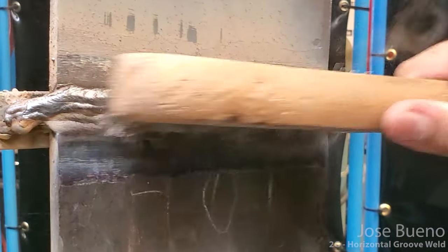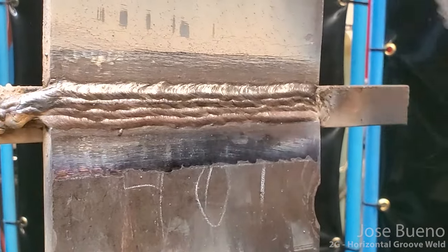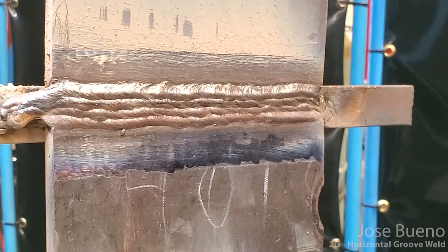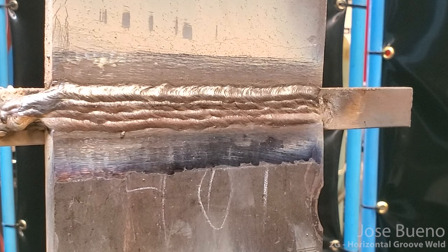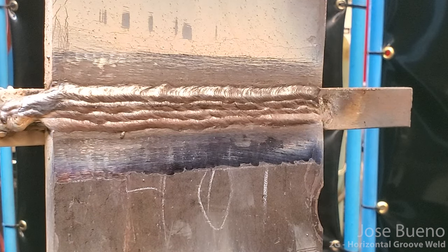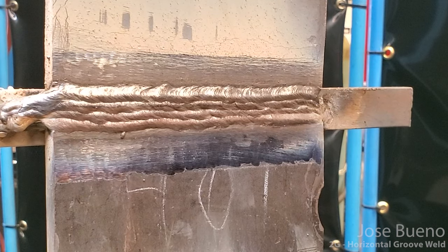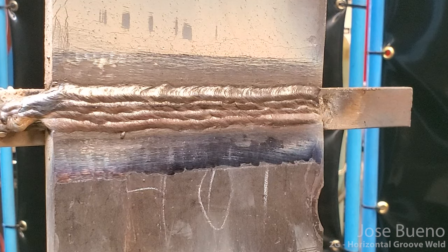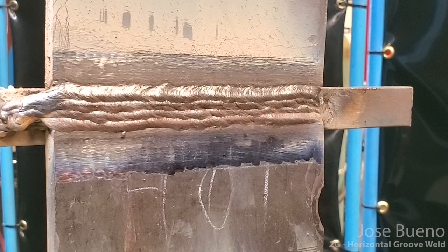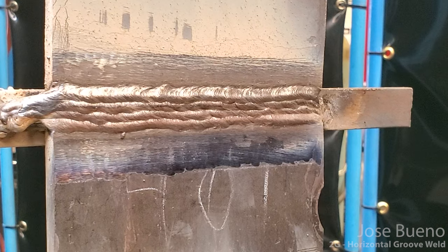Alright, so it looks like I was successful with that fourth really kind of rapid fast pass. And that's pretty much what we want to see. So now I'm going to go ahead and let this cool by itself, maybe away from a vent so that way it doesn't cool down too fast. I'm just going to let it cool down completely by itself to where I can touch it with my bare hands. And then we're going to go ahead and proceed with cutting the coupons out, and I'll show you how to cut or how to lay out the coupons once it cools